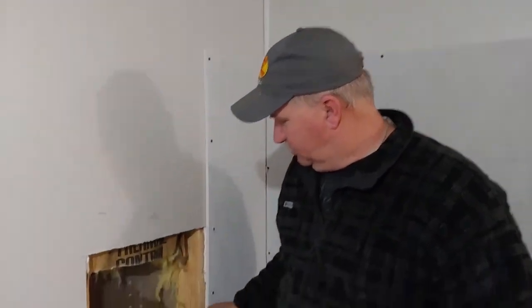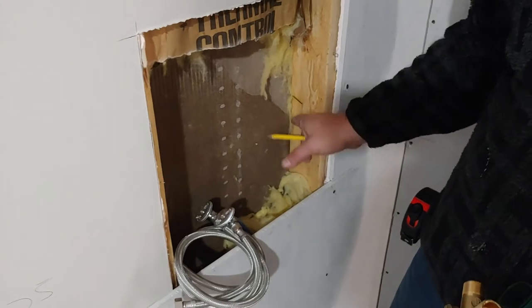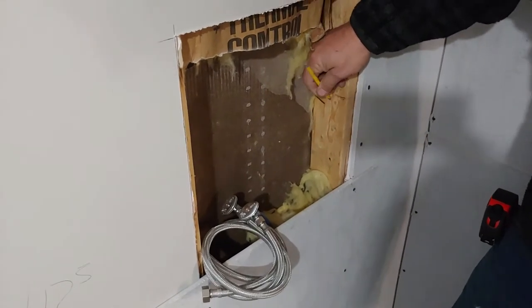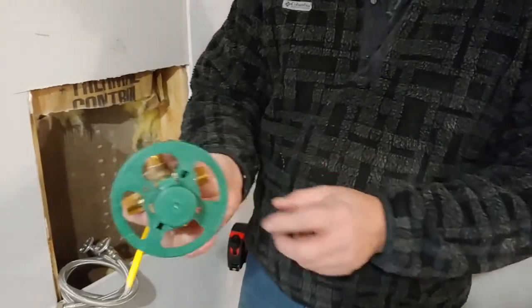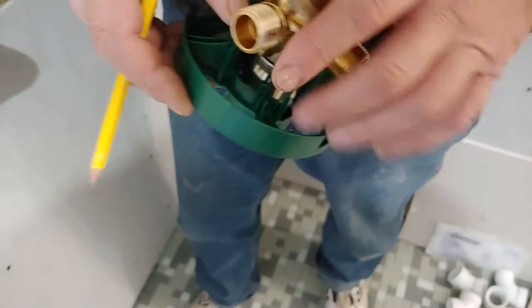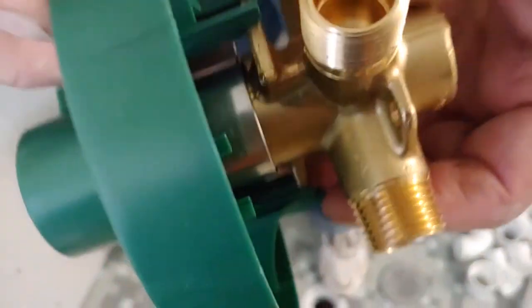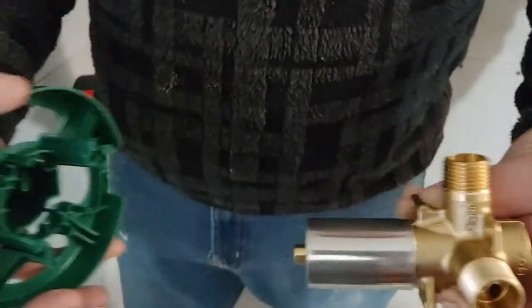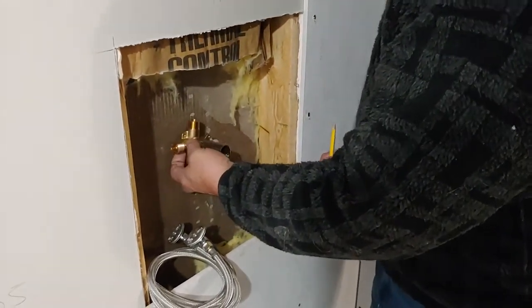And we'll put that 2x4 back there against the outside where we've got a staple to deal with. I made my marks where the center of it will be at 44. It has screw holes right there. So you take this bracket off, see these little clips right there? We need better lighting in here. But you take these little clips loose, pull them. I'm pulling it like so, on both of them. That way, whenever I put the 2x4 in here, I can put screws to it like so.